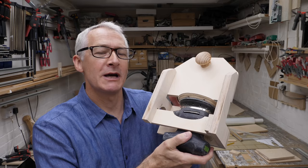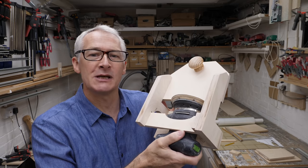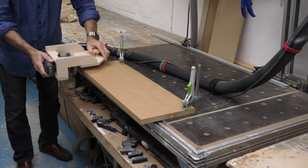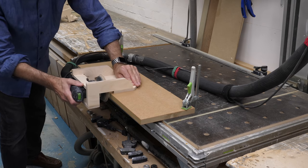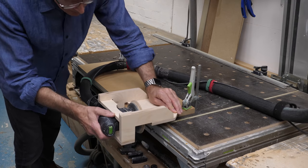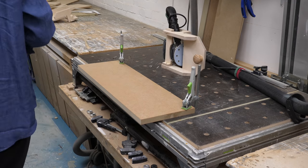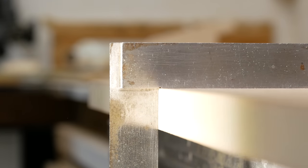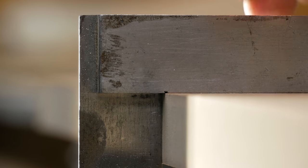And that's pretty much all there is to it. I had all kinds of elaborate schemes for clamping the sander down, but a simple plywood bar and a screw works just fine — it takes two seconds to fit or remove, and in the workshop there's always a screwdriver within reach. In use it's actually pretty great: the sander sits at a very comfortable height and the workpiece base provides enough support without getting in the way. If you're using this on a partially painted surface — de-nibbing for example — or on a polished workpiece, I'd probably cover the workpiece base in a soft cloth or some felt pads, but otherwise the plywood slides very smoothly.